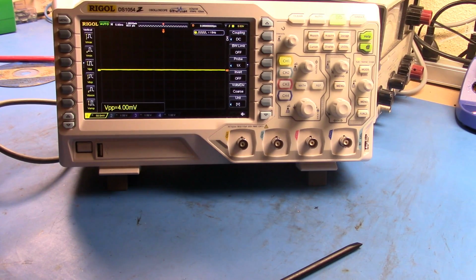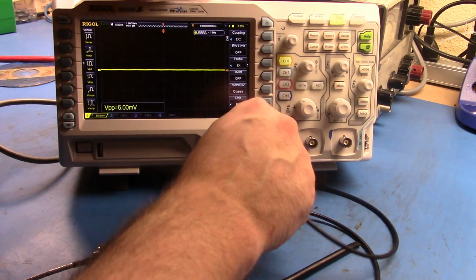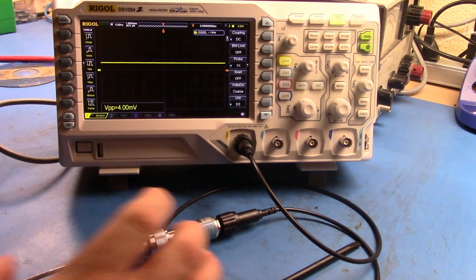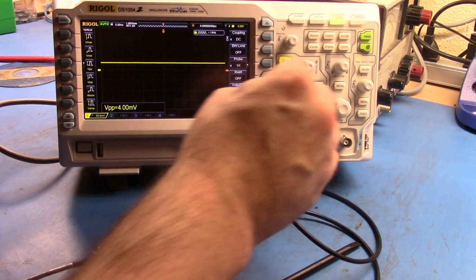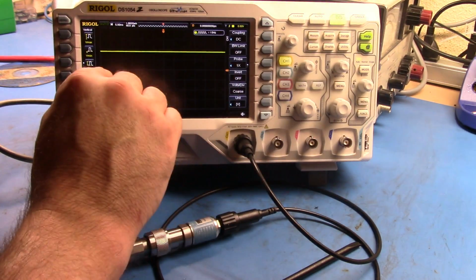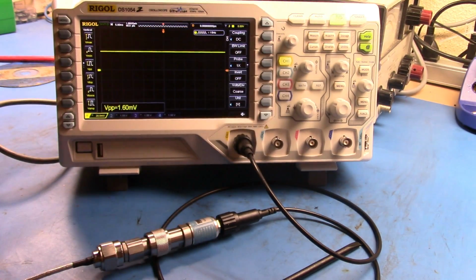And plug this back in here. Now, you'll see that we've jumped up. So what we're now getting is DC voltage, and that DC voltage is proportional to the power that's coming into the crystal detector. And that should be consistent, so if we step this in a bit, you'll see that we're very close to 2 graticules up.